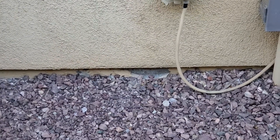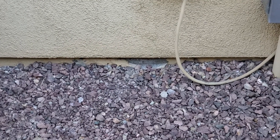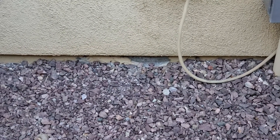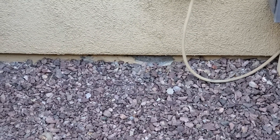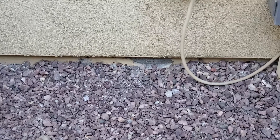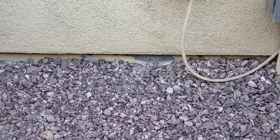This is another situation where the paint is being removed. Paint is painted down to the top of the dirt. The dirt gets wet below the paint, moisture transports the efflorescent salt, depositing it in concentrations, and over time removes the paint.